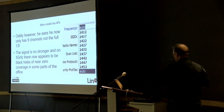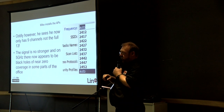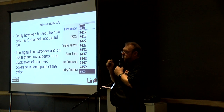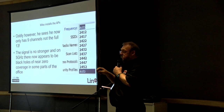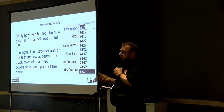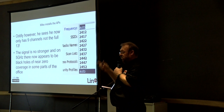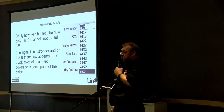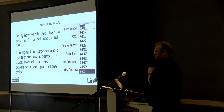He's learning very slowly. The other thing he's noticed is he's now finally got a tablet that does 5 GHz as well as 2.4. He walks around and finds that when he sits underneath one AP, he doesn't even see it at all. He logs into RouterOS settings and it's definitely operating, but there's nobody registered to it — nothing in the registration table, and the mobile device will not connect to it when it's in the room with the AP set to that 5 GHz channel.